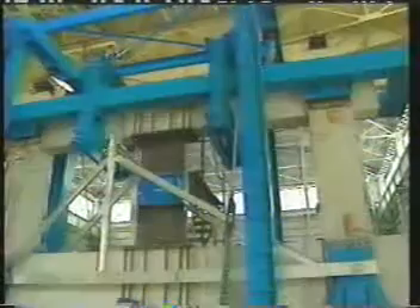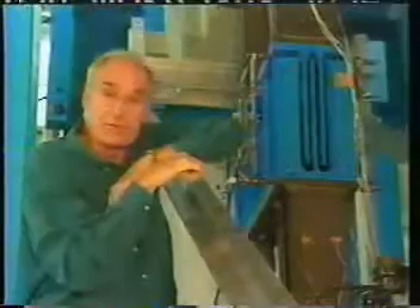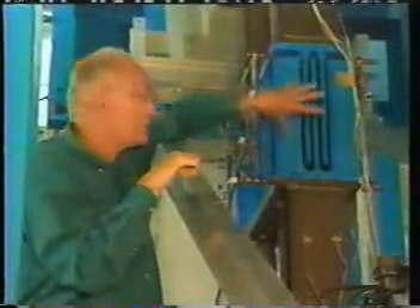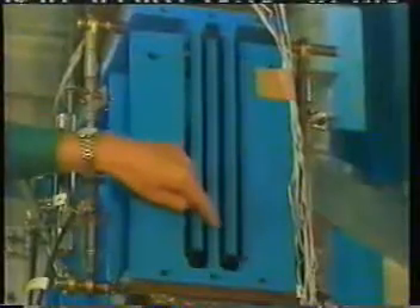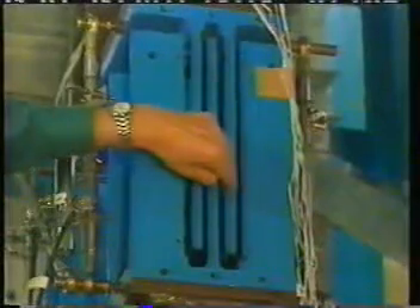As you can see, the great big gap in the middle would be a room. So this is the whole secret of a new system. Here's that central column, and here, coloured blue, are two steel plates — one coming up from the bottom, one coming down from the top — as fingers of steel, which don't quite touch each other, because in between those fingers is a very strong, viscous material. You can see it just black in between there.